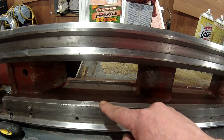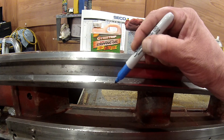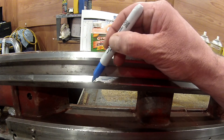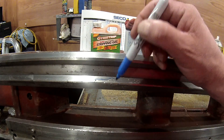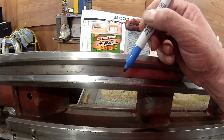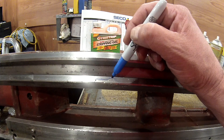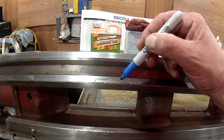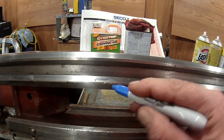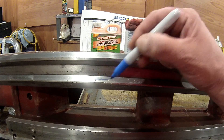What I did notice — I'm going to use a pen to kind of mark it here — right in this area you can kind of see there's a line going around, like so. It goes down around at the bottom, and you see little inclusions. This has been welded. I'm assuming it's not bronze; it's steel colored, so it was probably nickel welded, which is good if you're good at nickel welding cast iron. And then it looks like the ways have been reground after that, because you can see it's very smooth. So that was a good sign that this bed was damaged, but someone professionally reworked it with a good weld. Even though there are some inclusions, that shouldn't really hurt anything, and then they reground the ways.